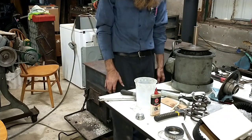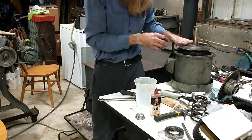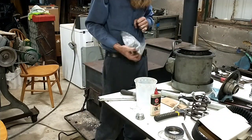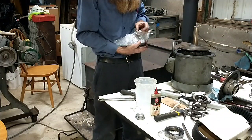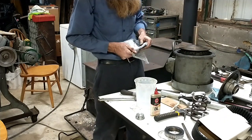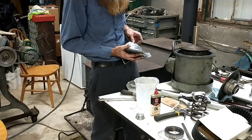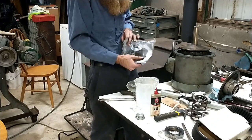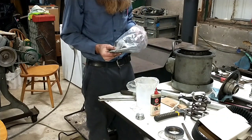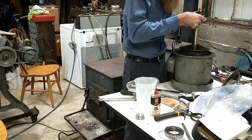Okay, so that motor is ready to install. I say ready to install. I guess technically I can put this on a minute. The new motor pulley. The old one, by the way, had hammered around so bad that it had the hole in the center wallowed out oversized by, I'm going to say, close to 1/8 of an inch.